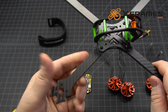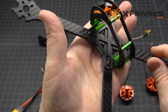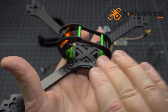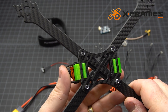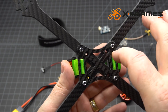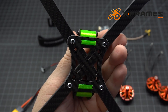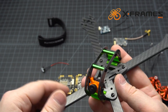This is a really interesting design. One thing I like about it is the ease of removing arms after a crash. What they've done is machined out these center arms and layered them on top of each other, mounting the two really strong top and bottom plates together. It's still nice and rigid but allows you to remove only four bolts and the arms come out. The way it's designed, the screws for the flight controller stack go all the way through, so you don't have to remove those to pull the bottom plate. Remove the bottom plate and the four arms come out — the stack in the center section stays completely in place. I really like that design.